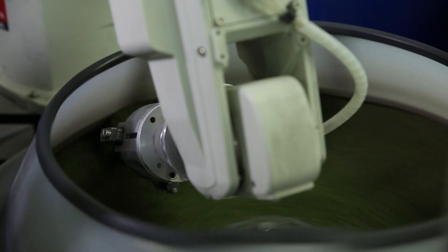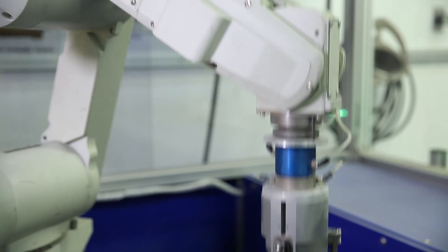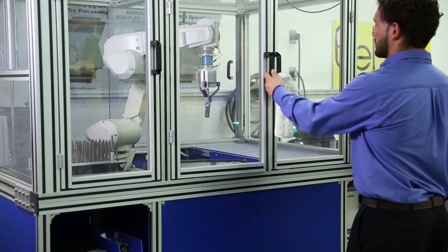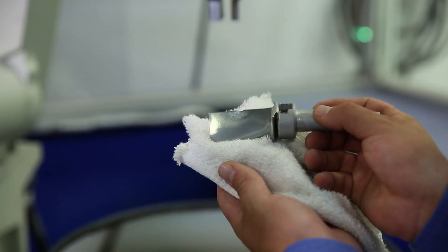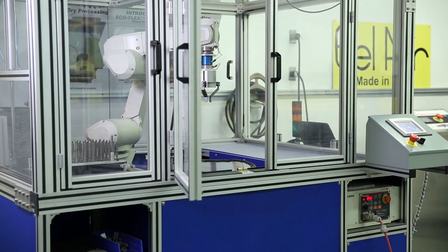This method usually eliminates 100% of the handwork, producing the shortest process time with fewer process steps, and has the ability to achieve single-digit RAs if required. It is very good for high-polished surfaces. The process makes it easy to incorporate JIT and cellular platforms, as well as one-piece flow, and is naturally automated.